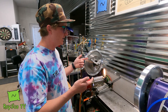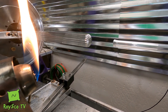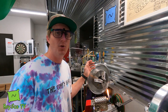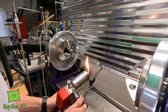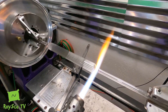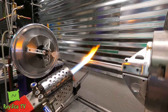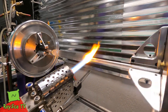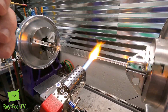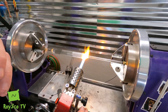We're back over here at the lathe ready to make this neck. I already closed up the end of that Contrax and made a hole for the blow tube — it's the right size. It's pretty much like a cooking show but with glass. I skip the boring steps for you. Now we're going to seal this up and start shaping the neck. The crazy thing about working with Contrax is, as you saw, parts of it are super thick and parts are super thin, so the heat distribution changes and parts want to blow out faster than others. Compared to the extra heavy wall tubing I was just using, this is much thinner so everything happens a lot faster.